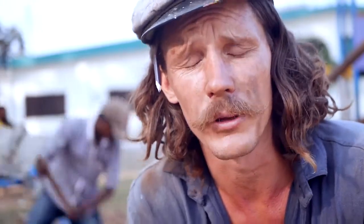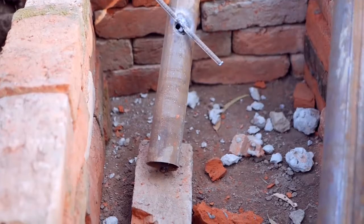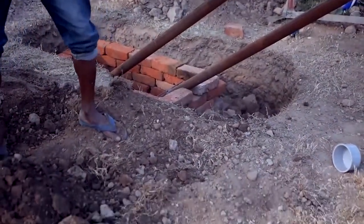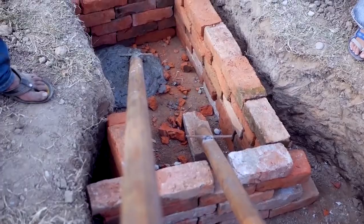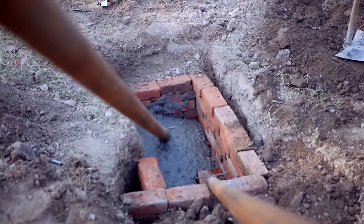We've got a couple of little anchor pieces as well that we've welded onto the metal and they just hold the whole thing in place much more firmly. If you've just got straight metal going into the ground, it's going to hold, but it will be much stronger when you put a little anchor piece on there to hold the whole thing in really tight. On top of that, we've actually gone a little bit larger than we needed with the hole, making a little bit of a wall using some bricks to hold the cement in place, just so we have enough to hold the whole thing together. And then we're going to cement these ones into the ground.